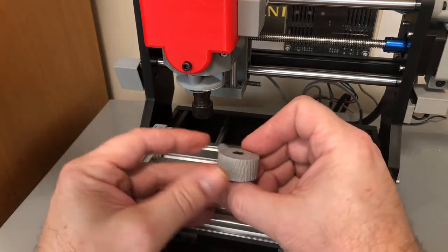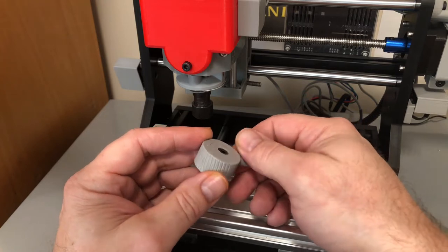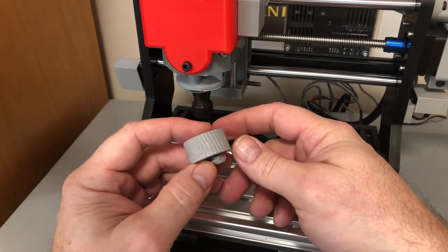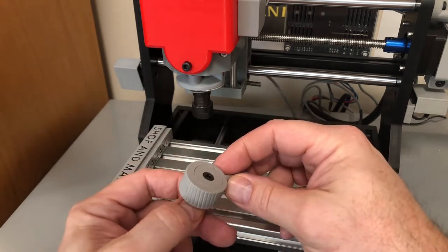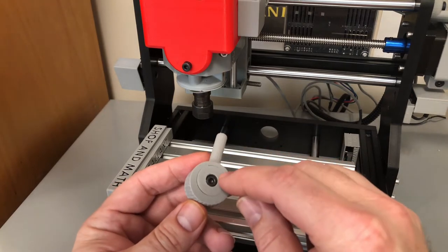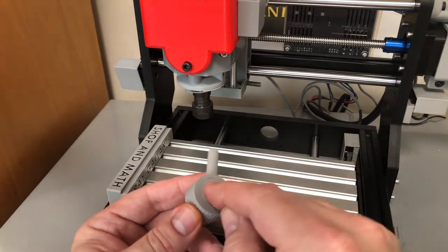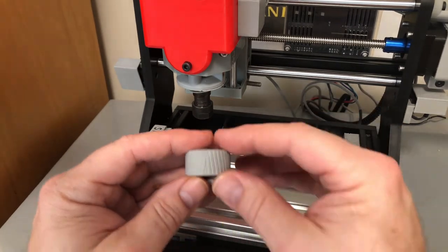A cam works for odd-shape pieces, square pieces — a cam will hold almost anything. But unfortunately, a cam is still a cam no matter what you do to it, so under heavy vibration they come loose. There are ways of making the inside shorter than the outside so your final clamp will actually lock it in place — there are some tricks you can do.